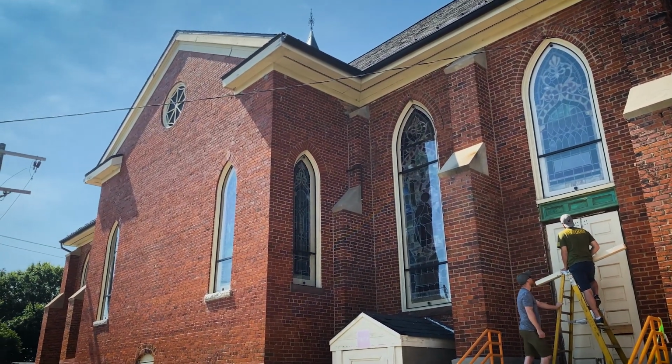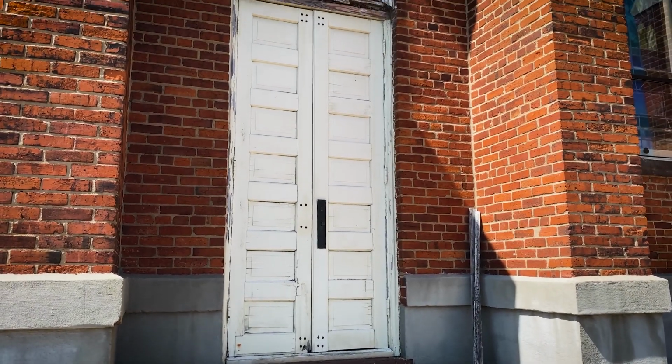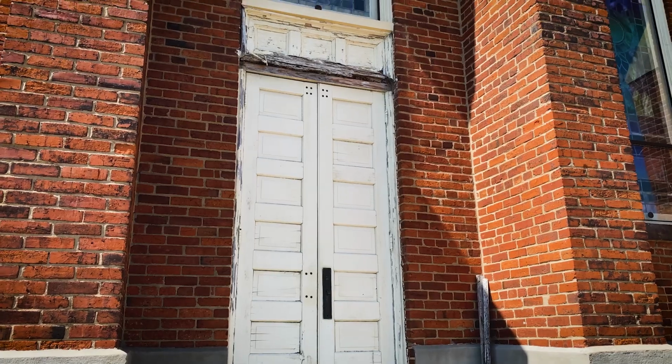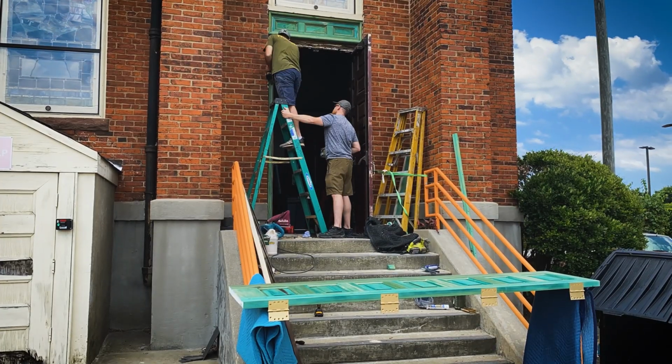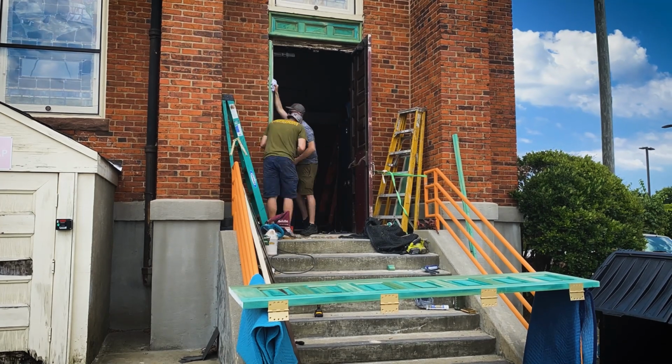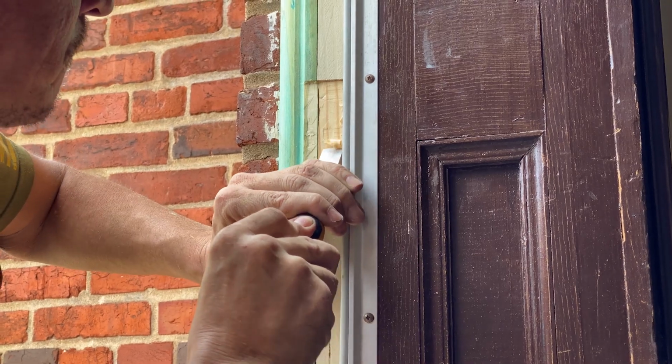In an older building, the door frame is rarely square due to natural settling and shifting over time. When new, perfectly square doors are made, they may not fit into the uneven old door frame. The frame was also deteriorated where the hinges were mounted. Screws were stripped, and the wood was rotting.